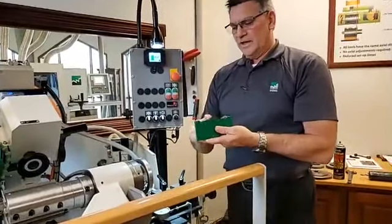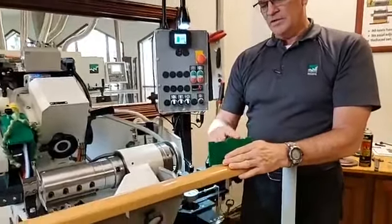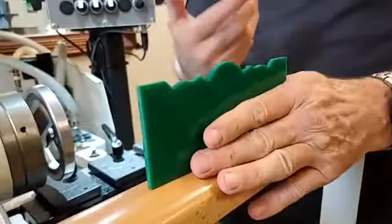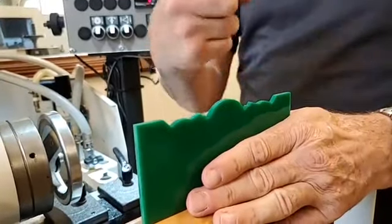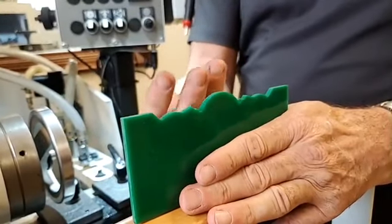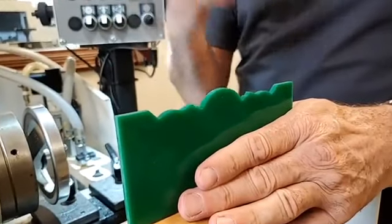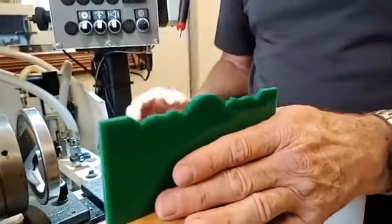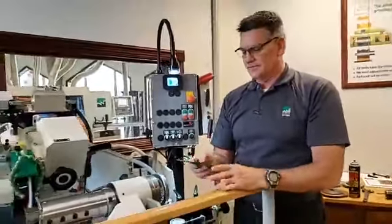So, Sean, how do we keep this from being so abrasive? Just looking at this being a crown mold, you've got this pretty tall radius up in here. What I would generally do is wrap it with a very fine grit sandpaper around something that's kind of hard. So we can just put it on there and gently rub across. All we're doing is looking to knock the peaks off of those bit edges or steps in the plastic through there. We just want to knock them off. So it's not so abrasive on our tracing pin and it doesn't come through in the finished grind itself.